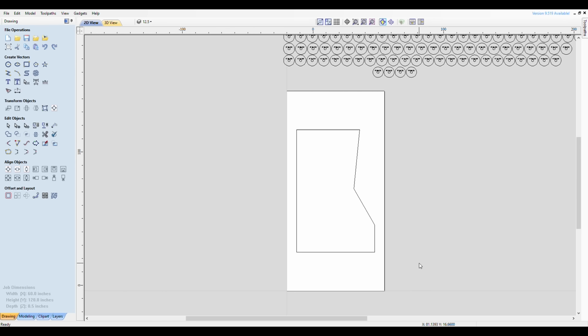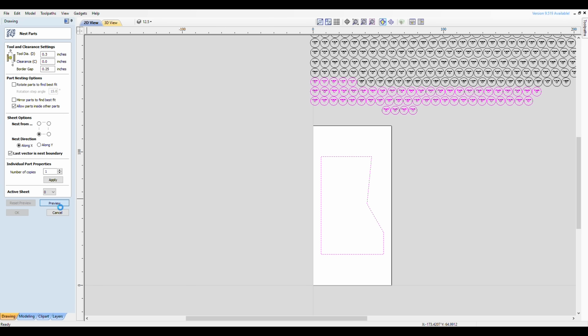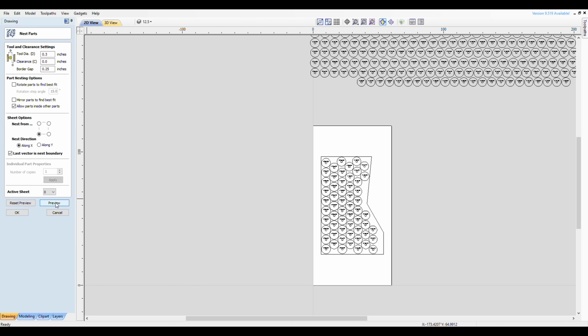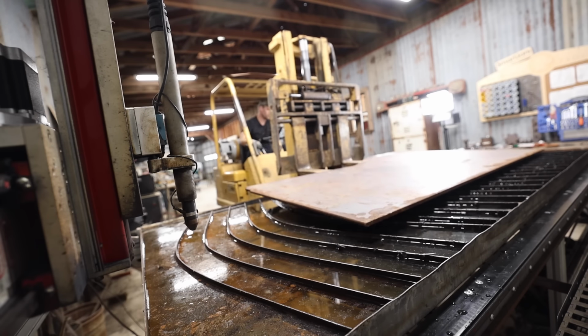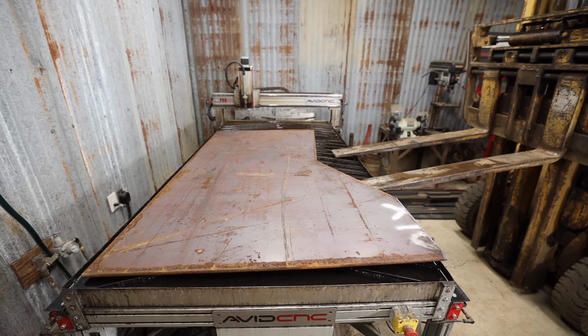I'm cutting the plates for the dumbbells out of remnant pieces of 1/2-inch plate. Once I got them trimmed down to fit on the CNC plasma table, I measured and redrew the same shape in the software so I could use the automatic nesting feature to fit as many of the plates on it as I could.